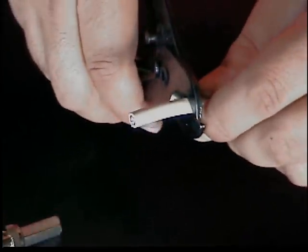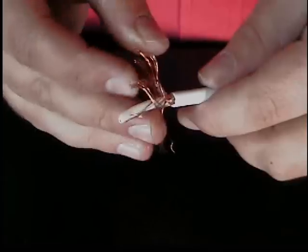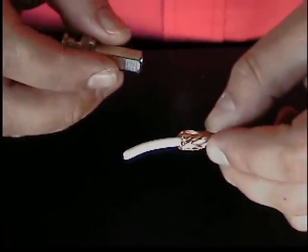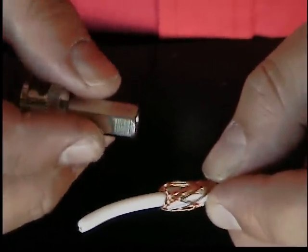If you haven't done these in a while, it'll take practice. Once you do one or two of them, you've got it down. So let's go ahead and strip the jacket off the coax here. You'll notice we have a copper shield — this is very important that you leave on, don't cut this off. The connector will make a ground to the shield, and this will avoid the shadowing effect on your monitor for your security cameras.